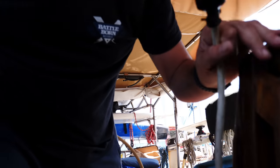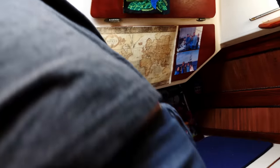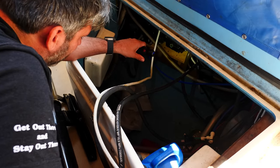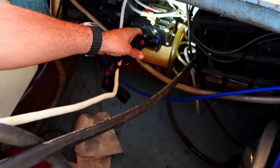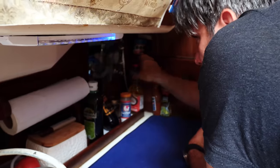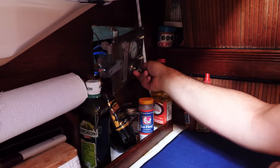We just hooked up, our Y valve failed, which is why the air conditioner wasn't working. So I had to hook up the intake. I hear the boost pump going. I see water trying to get to the high pressure pump. See right there? See it almost in the pump? Yeah. I'm gonna hit a little fresh water. Solid pressure.